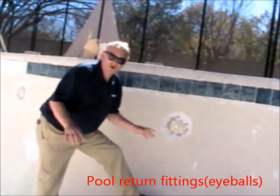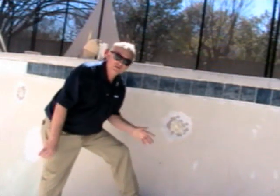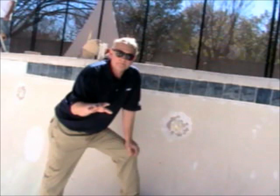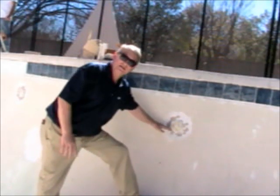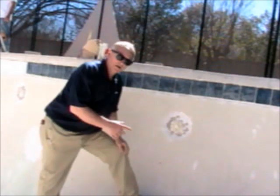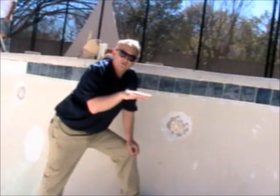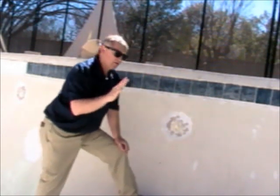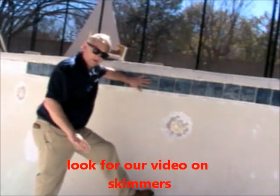If you research this, you're going to get opinions all over the place about how they should face up or down. I'll tell you what I like. I like them all to face up a little bit in the same direction so that the pool, when it's turned on, will circulate so that if anything settles or lands on the surface of the pool, it'll get caught in that tide or that current and it'll get pushed up to the tile.